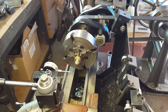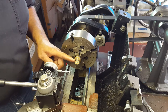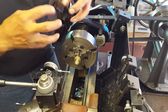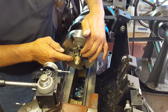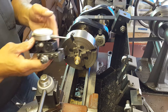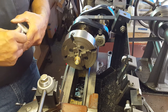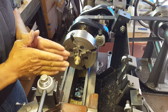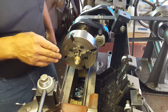My cone nuts to the rescue again. I basically got it centered in here, trapped between the two nuts, and the inside nut is hard up against the jaws. I just finished zeroing it in with my dial indicator and it's dead on. There's a slight little movement this way, but spinning this way it's true.